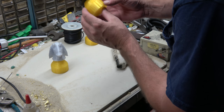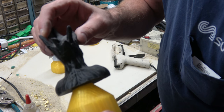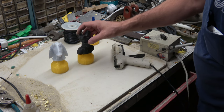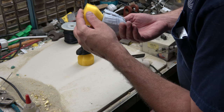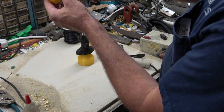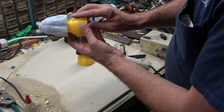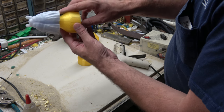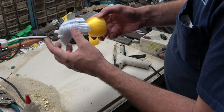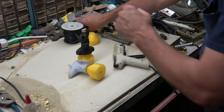I see something already, that there's a slight bit of a gap underneath the sprue base and the back of it, so I'll have to wax that in or something. And Jar Jar looks like he sat down pretty good. He's also got these big long floppy ears coming down here, and I'm going to have to put a couple little vent wires on them so that they fill properly. And just use a little bit of wax wire.